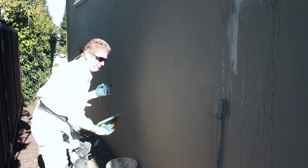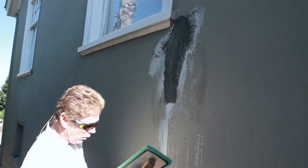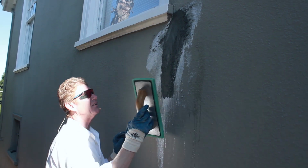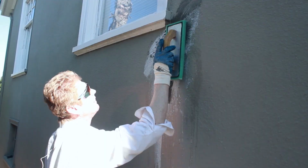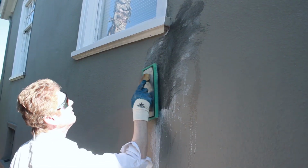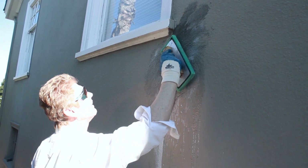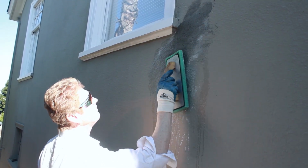And remember, you can't float all caulkings. If some of them clean up with water, you can float them. The ones that are polyurethanes like Sikaflex, Moist Stop, you can't do this, so don't try it. Anyhow, guys, now I'm going to float this. And because it has the sand in it, and because this is such a heavy finish, it'll match a lot better. A lot better, guys.